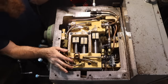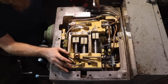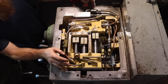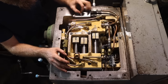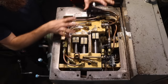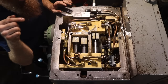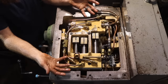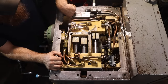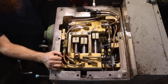So there is an auxiliary or a little hydraulic pump right down in the case here. And then there's the main one on the side where we replace the green belt. The main one on the side feeds up here and basically goes into this control block, and it feeds the head. And all of these lines are then basically engaged to, at certain times, spray extra fluid on certain gears in certain speeds. And so the other little pump, I'm not exactly sure what it does, but I'm pretty sure it just gives additional fluid on the backside.